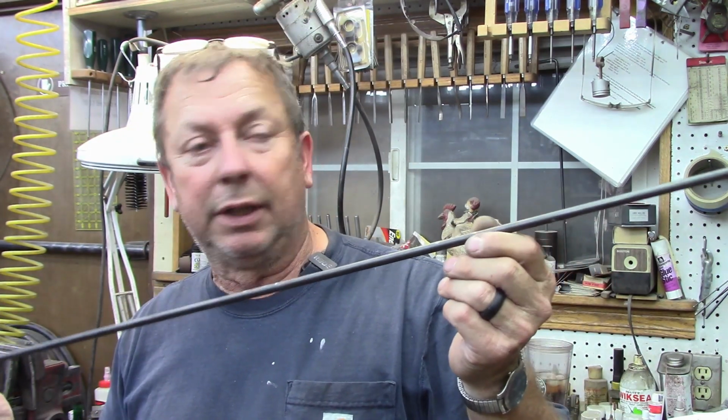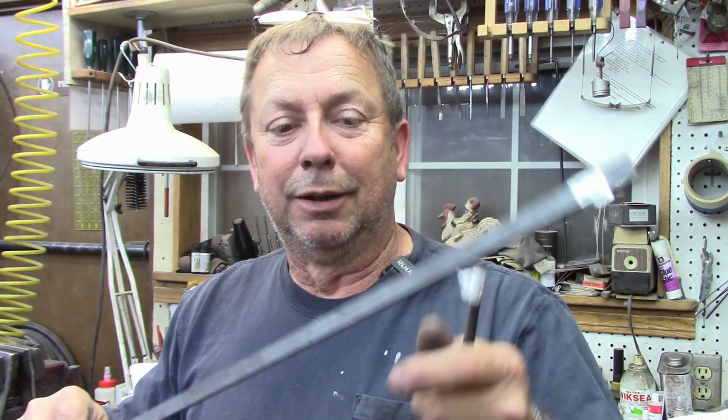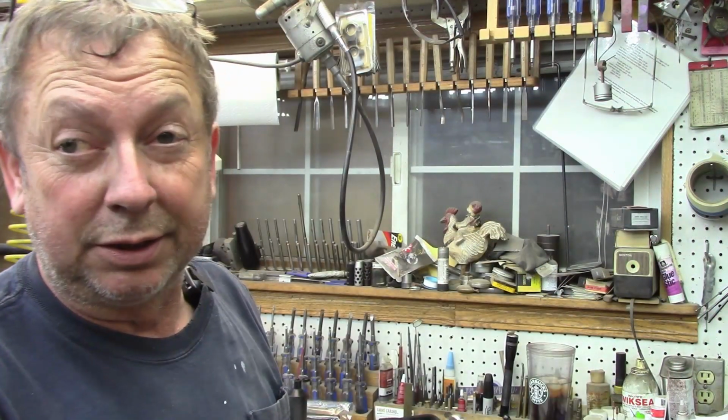So I bought a 4-foot length of 5/16 weld steel. This is not the plated steel, and I paid more for this than I would have for the plated steel, but for this application I think it's a little bit better. And for the gibs, I bought another 4-foot section of 1/8 inch thick by 1/2 inch wide weld steel. I've seen the pins offered on Fleabay for about $10 a set at the least.